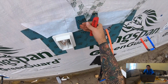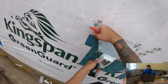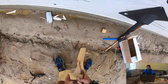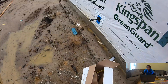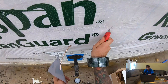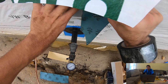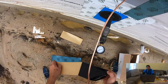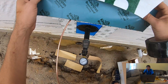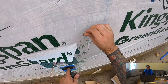This is pretty much it for almost everything when you're doing this weatherproofing — it's just one after the other; it either has a specific piece for it or it doesn't. We're continuing on, picking up garbage as we go. For this ground wire for the gas, I've put it up a little bit higher because this company likes the weather flashing on it. You can't stub it out the same way with gas in this situation — you'll just have to bring it down when you're going to trim it out.